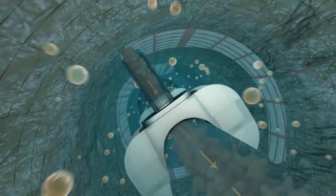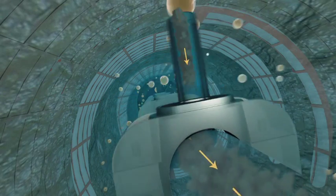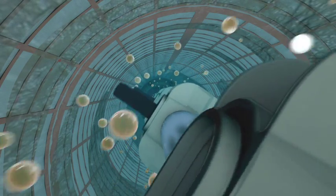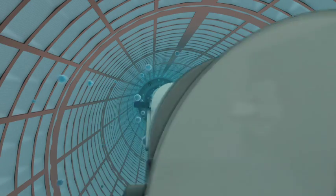The suction force causes water to flow backwards through a small area in front of each nozzle, pulling the filter cake off the screen and expelling it out of the filter through the flush valve. When the first outward cleaning stroke is completed, a second flushing cycle is triggered, pushing the suction scanner inward to its original position.